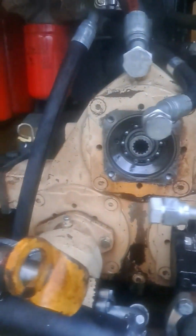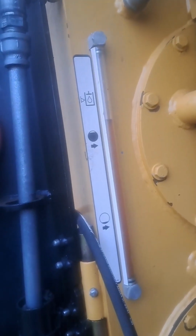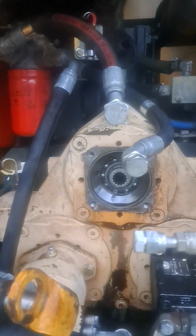There it is, the vacuum pump's off. Even with it off and everything plugged off, we're still holding above where our original point was. So that's what came out of the pumps. When we go back, we'll pull the vacuum again to reinstall the pump, hook the lines up, and then we'll blow compressed air through that hose that went to the vacuum pump and push that oil back into the pumps.